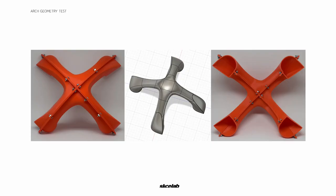We started in Fusion 360 creating a quick little prototype that had a model with all the features we wanted for the final table. This included having sharp edges, organic forms, and a uniting piece at the top. We also wanted to make sure that we poured it flat from the top, so we had to create four openings at the bottom through which the concrete was funneled.